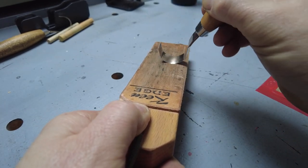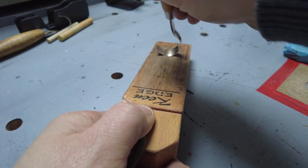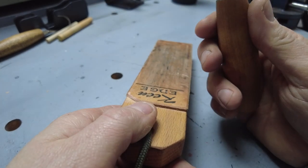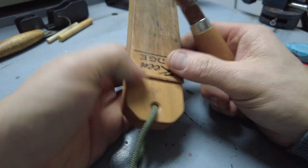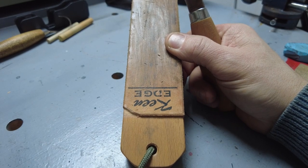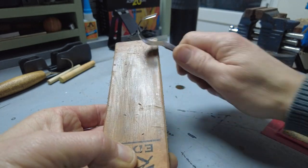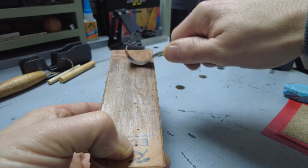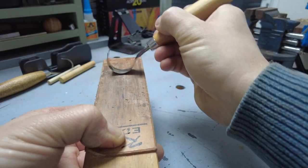The trouble is if you go too far you start losing your angle — you can see it wobbling a little bit as you go around. When you first start out it's probably better to do it in sections and really concentrate on keeping that angle right. This one is a double-sided knife so I basically repeat the process, coming back the other way on the other side.